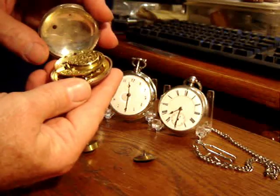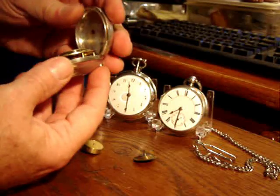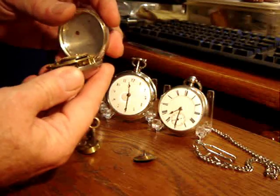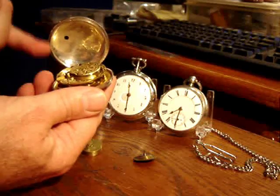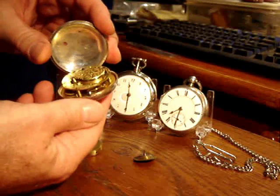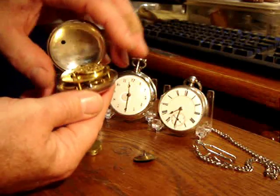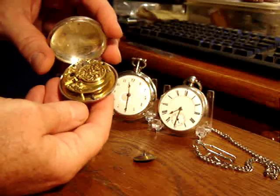The hairspring was rusted and very thin. I've made a hairspring, and this watch will run in certain positions, but I don't try to run it that much as it's so old. I don't want to risk breaking something even further. This watch was made by a watchmaker named William Hopetown in 1798.